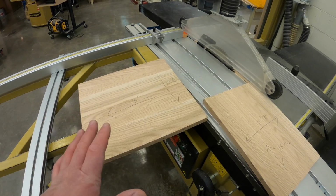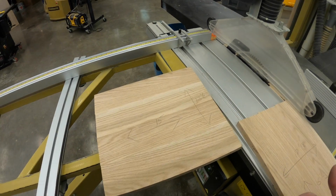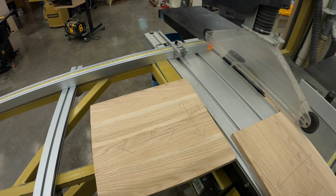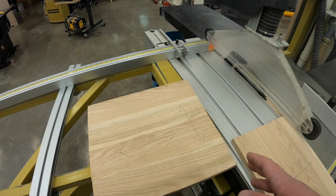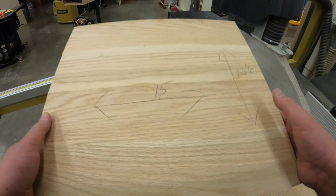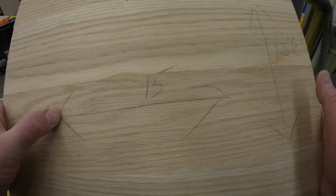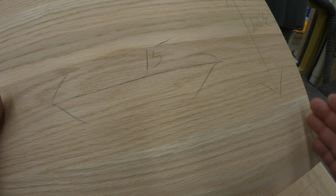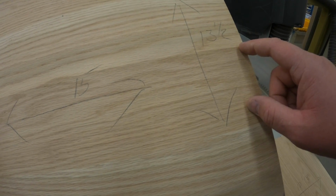All right, I'm here at the table saw. Before we cut, we wanna verify our sizes, not only on the plans, but also measuring the physical opening that we have created of the door and the physical size of the box for the top. And so after verifying those, I've written my sizes on here. I need to finish this board at 15 inches with the grain here, 15 inches. I'm gonna cut across the grain. And this way I'm gonna be at 13 and a half, okay?